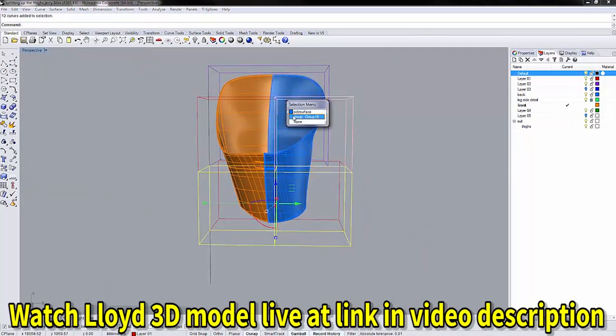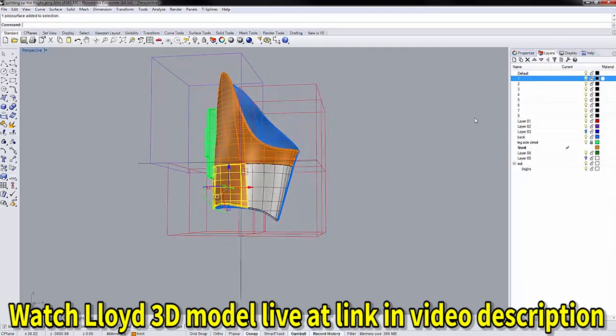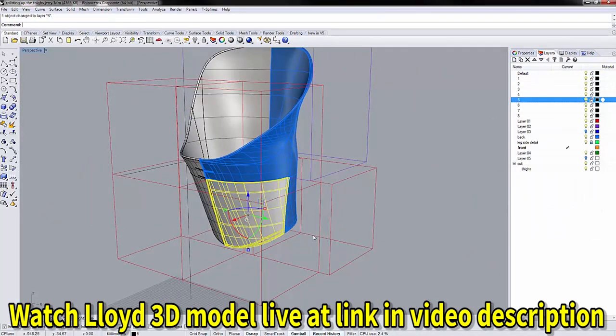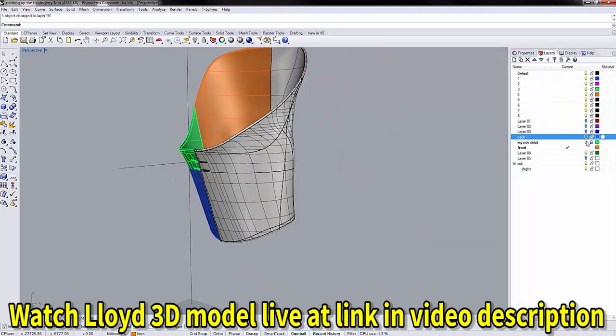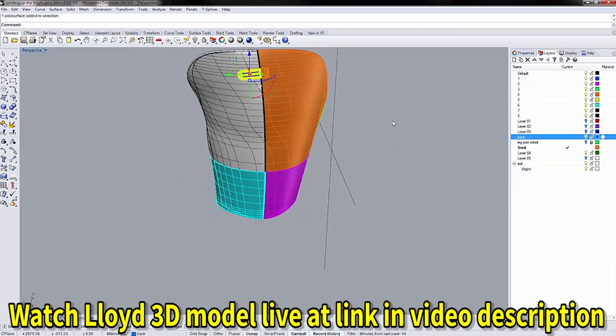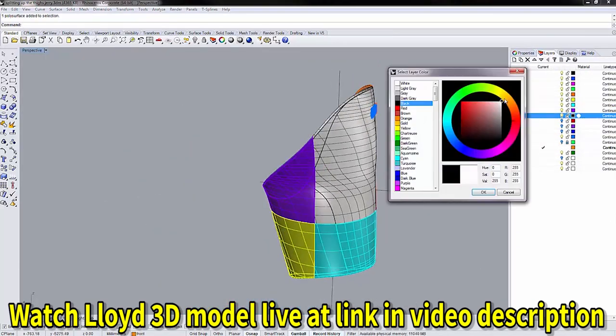Now, the build volume on these desktop 3D printers can vary, but generally speaking, it's between 7 to 8 inches cubed on most desktop 3D printers, unless you're looking at some of the cheaper under $1,000 printers, which have much smaller build volumes, somewhere in the 5 to 6 range. But at any rate, the pieces have to be reduced in size so that each piece can be printed and then assembled into the larger pieces.